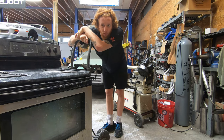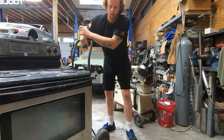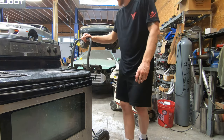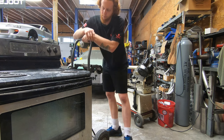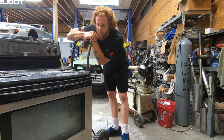And we're back for the second day of trying to dissolve this broken tap out of the YXZ head flange block. So I went ahead and got a few more little containers of alum. So hopefully five is enough to get this dissolved the rest of the way out of this aluminum block. If not, then I'll have to get more, keep repeating the process. I guess without further ado, let me get the range set up the rest of the way and get some water in our little pan, get some heat going through it, and let's start dissolving this tap again.